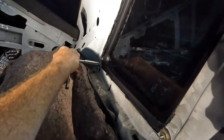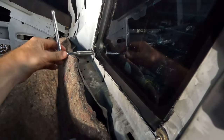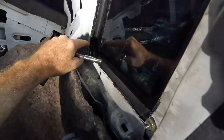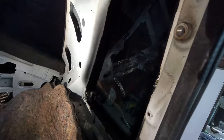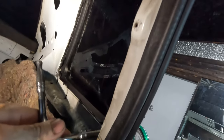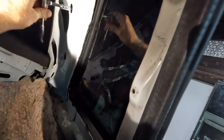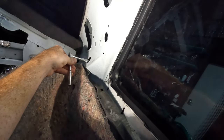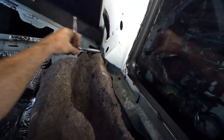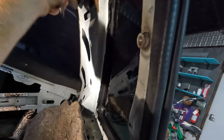So far so good — the window is sitting in quite nicely. I'm going through without power tools, keeping my eye on the stud area and looking for movement. Before, I could see the stud moving when I was drawing the nut down; I don't see that now. Just work your way around in a circle, don't do anything too crazy in terms of tightness, make sure you get all your studs secure. That one feels really good, that one feels really good.